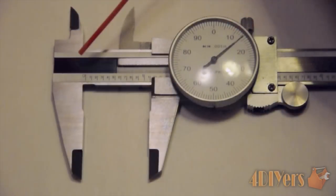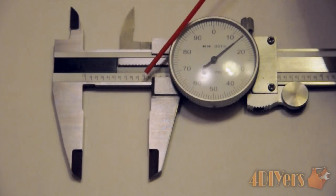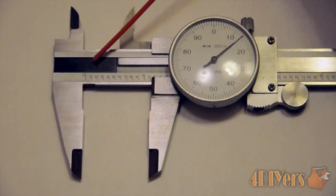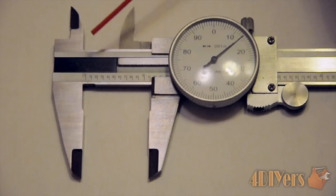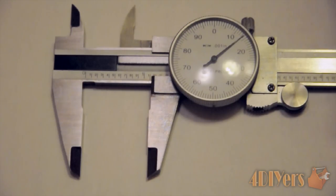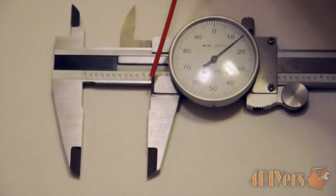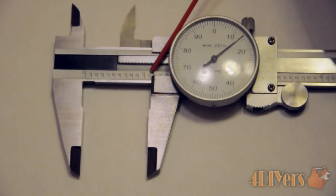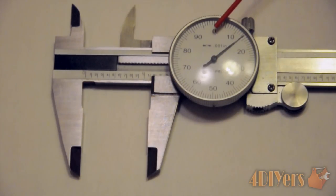On the larger scale, the larger numbers with larger lines are the one inch marks. Starting from zero and moving up to one inch, and so on up to the maximum measurement — six inches in this case. The smaller lines measure the first decimal place, or tenths: one tenth, two tenths, three tenths, four tenths, and so forth until reaching one inch and starting over. The position of the small metal tab on the scale indicates where you are, and every time the needle passes zero on the dial, you have moved a full tenth.